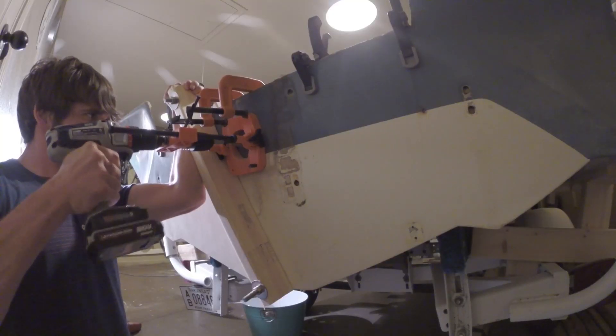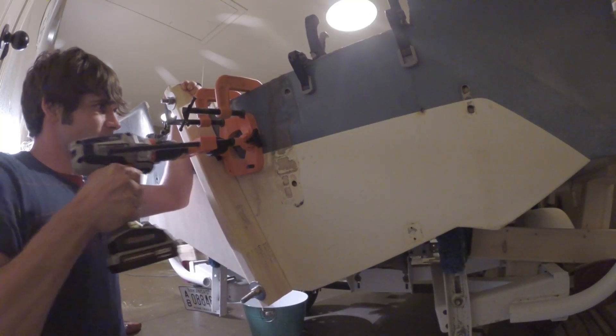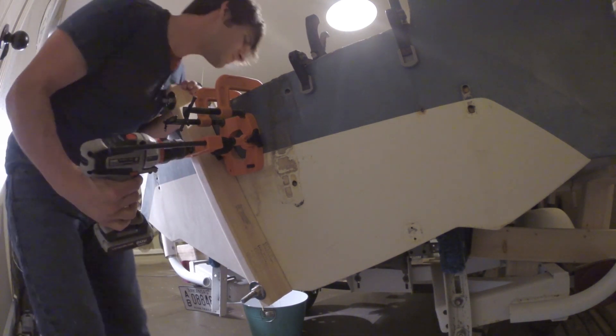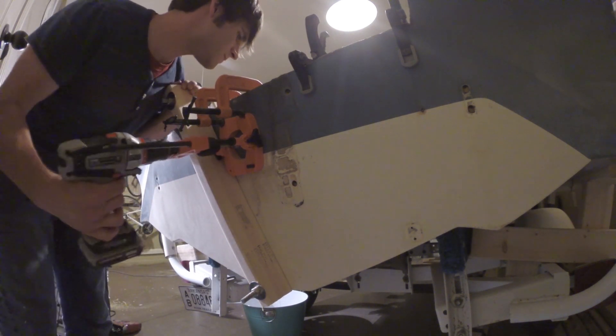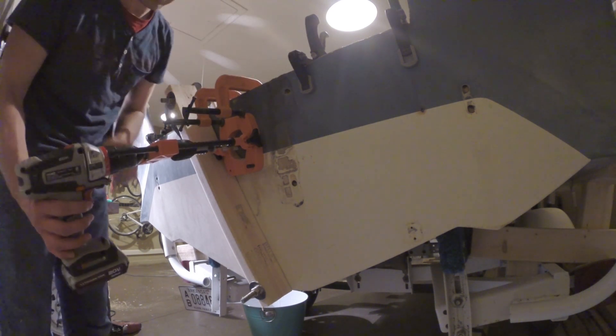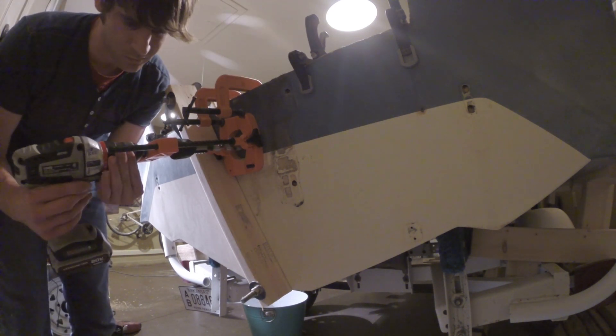The reason I'm doing this now without the glue is so that I could drill my holes for the bolts — the motor mounts and the top drain. I'm doing this first because the 2x4 and all-thread clamps that I have made need to bolt through these holes so that the transom and the hull get a good bond and a tight fit.